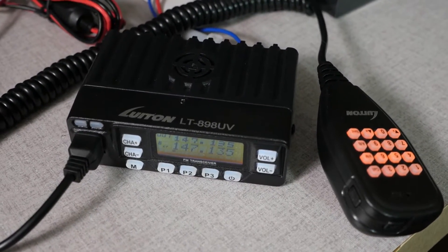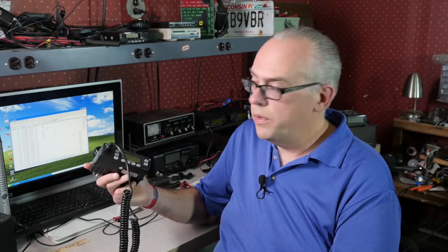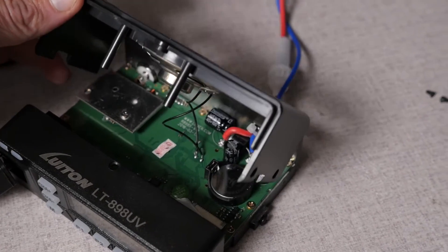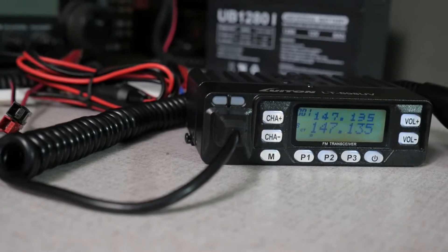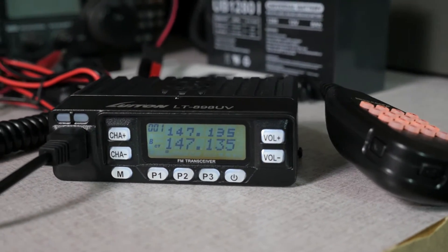With a selling price in the neighborhood of $60 to $70, I took the plunge and picked up this radio. Basically, what this thing is is nothing more than a Baofeng handheld where they took the processor board out of the handheld, slapped it in a little bigger chassis, gave it a little more powerful final PA — a bigger transistor for the final output — and gave it a more mobile-friendly screen and display.